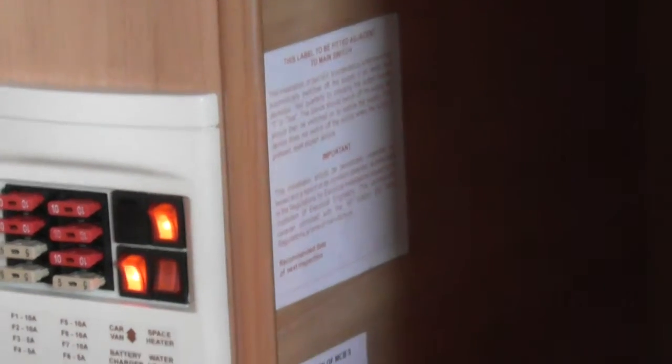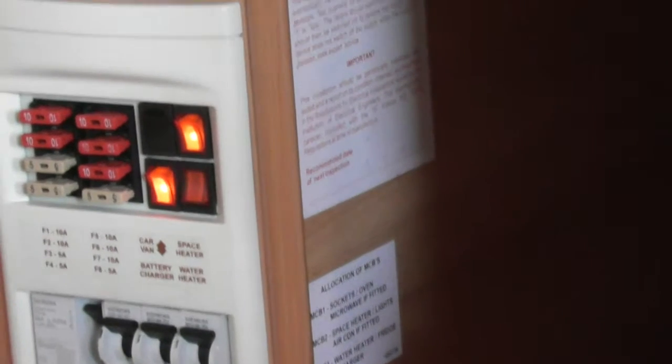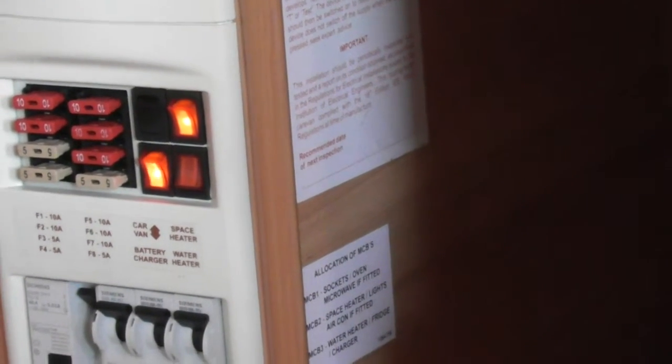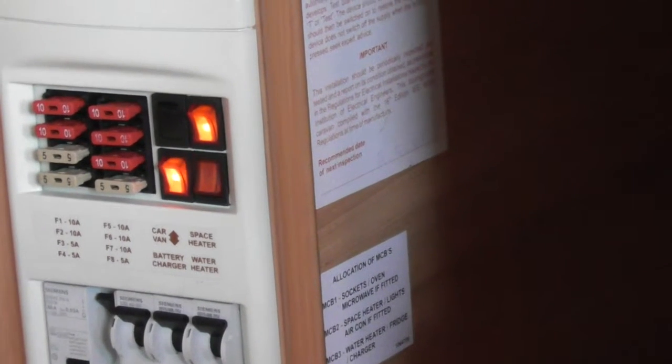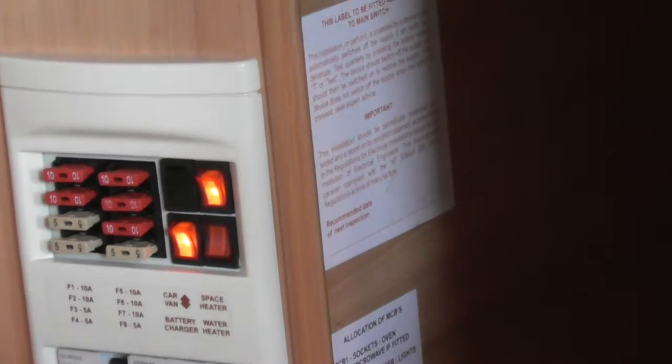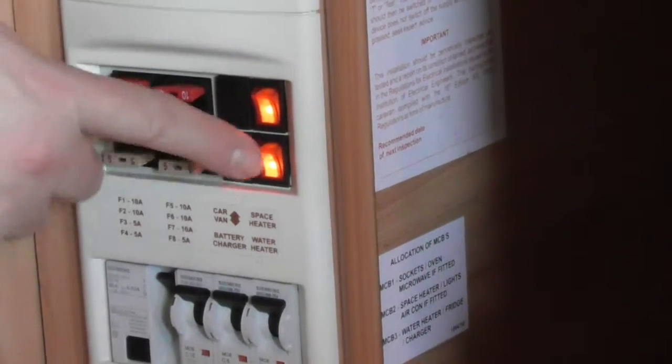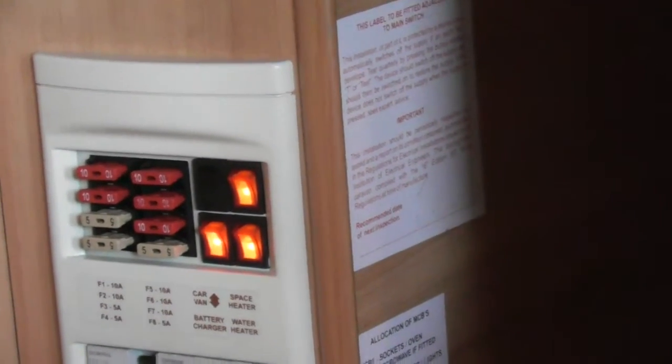The main reason we say switch it off is because next time you come to your van, the first thing we all do is plug our electric in, and then you gas bag to the neighbours, and before you know it, you're coming in, what's that smell? Before you know it, you've burnt your element out. So please just get into a habit of switching that off before you're finished. So as I say, once this is switched on inside here, that's that boiler heating up instantly.